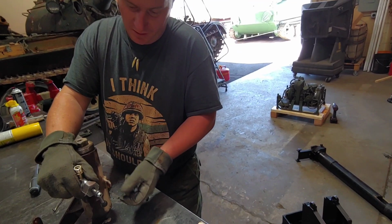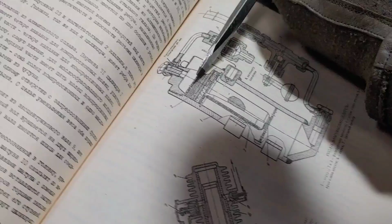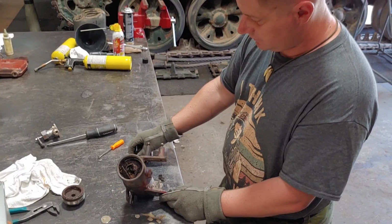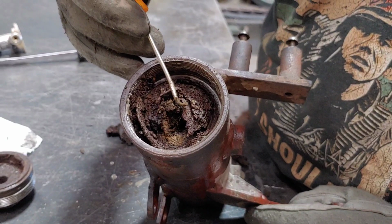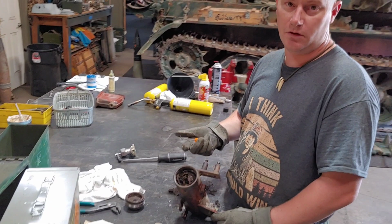Then what you do is you crank this tap open and it allows you to drain the water that builds up inside this. So one of the problems that we've had, and as you can see in the manual here, this represents this unit here. These are the filter elements. Each one of those is like a felt disc, if you will. Well, due to poor maintenance that hasn't been addressed, we've pulled the top off the filter element and the filters have become so clogged that 2000 psi of air has just blown the whole entire center out of the filter system. Jesus. So yeah, these have become so clogged that they blew a hole right through that. Eventually that pressure buildup has just shot a hole right through the middle of the filter stack. So what do we do at this point?